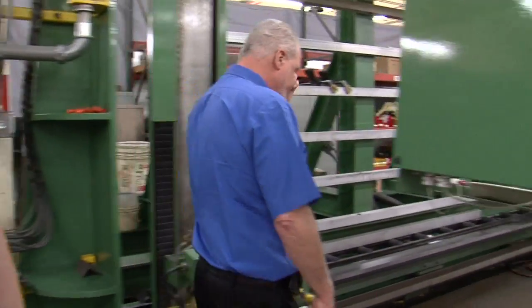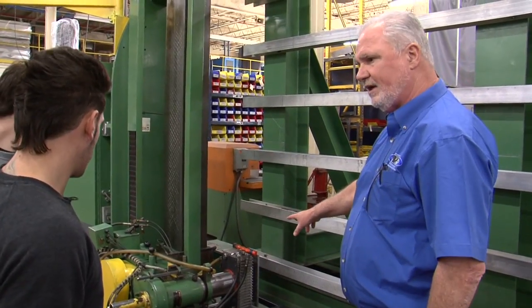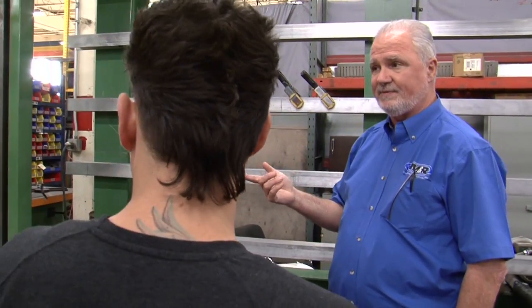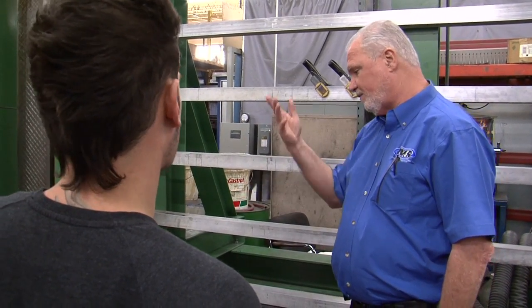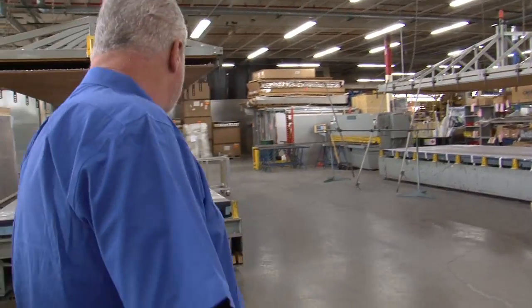These drills are multi-spindles. They have 78 spindles per head. So we step and repeat and we'll drill 78 holes at a time. So in a textile application, we can make vacuum pallets to hold transfer paper or for graphics printing to hold the regular sheet stock. These are presses, laminators.